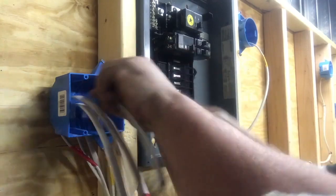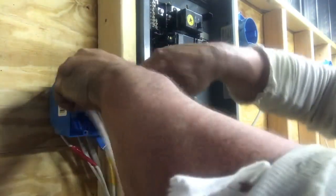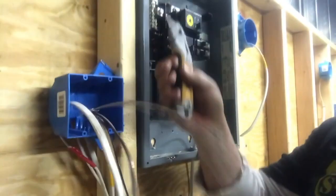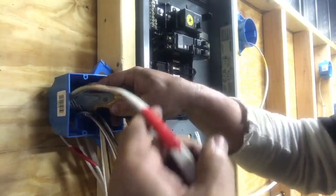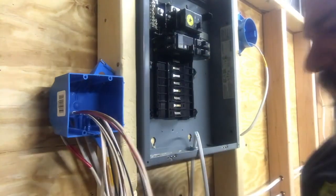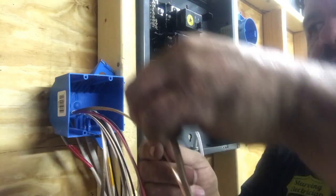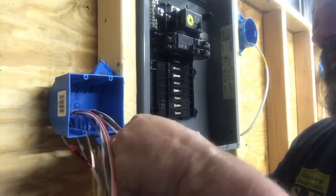Pull my wires off. Let's do all of these. Pull those off. Here's my three wire — that's pretty easy to see. I label it red, but you already know because there's a red in there. You already know it's a three wire. First thing we do, take your grounds, push that paper up, and pull it off. Simple — pull off all of them.